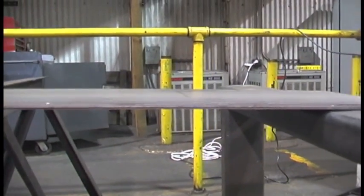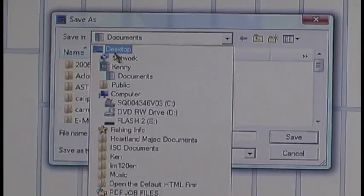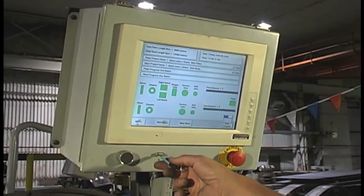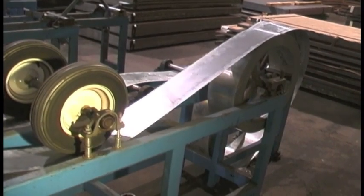After the product is designed on the computer and downloaded to the flash drive, we come out to the roll former and we're prepared to make whatever the product is we have to make at the time. So right now, Ken is going to prepare to make a wall panel. What's nice about these steel frame machines is the ability to use touch screens once we've downloaded the software from the flash drive into the machine.